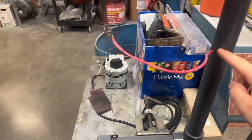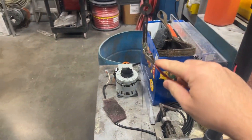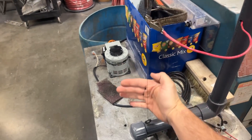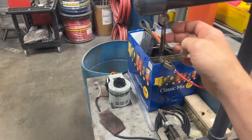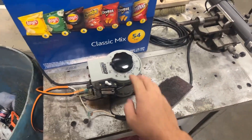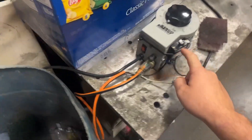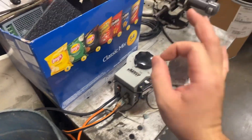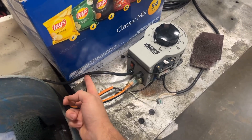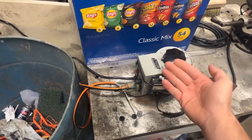The other wire comes up here to this, which I just soldered onto an alligator clip — just crap I picked up at my local hardware store, nothing fancy. The spring up here allows it to take up slack in this wire. When it gets hot, it stretches, so I need something to keep tension on this wire. All of this is connected to an AC variable transformer with a breaker. The only reason I have the breaker is because the secondary side of this transformer has a 12-amp fuse and it's pretty easy to blow if you get heavy-handed on the dial. This is my input power from the wall, this is the output from the secondary, and I have a loop here so I can monitor it with my ammeter to know when I'm getting close to the breaker.